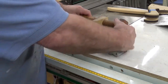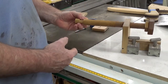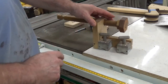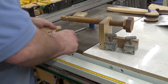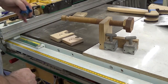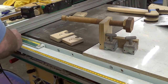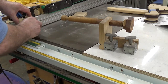The jig itself has a nut on it, and this little tenon part on the end here held down by a pair of mag switches. I'll go into a little bit more on these mag switches later. One of the major features are these little bits of wood that hold this tenon against the fence. I'm very fortunate that my fence has got this T-track in it, so let's just attach this little captivator.